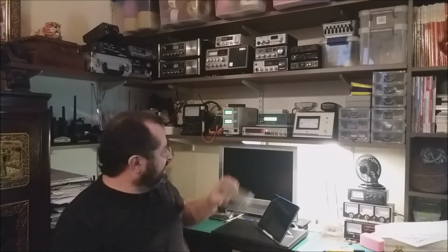Now what somebody suggested, and it sounded a pretty good idea to me, is radio, filter, amplifier, but make sure that you underdrive, you really run that amplifier relaxed. And they said run at half rated input. So if you've got an amp that will take 10 watts in, run it at 5 watts in. That's it. So that sounded pretty fair advice. And of course you can always run filter before and after your amplifier just to make sure. But certainly worth putting something like that in, and avoid any potential problems.